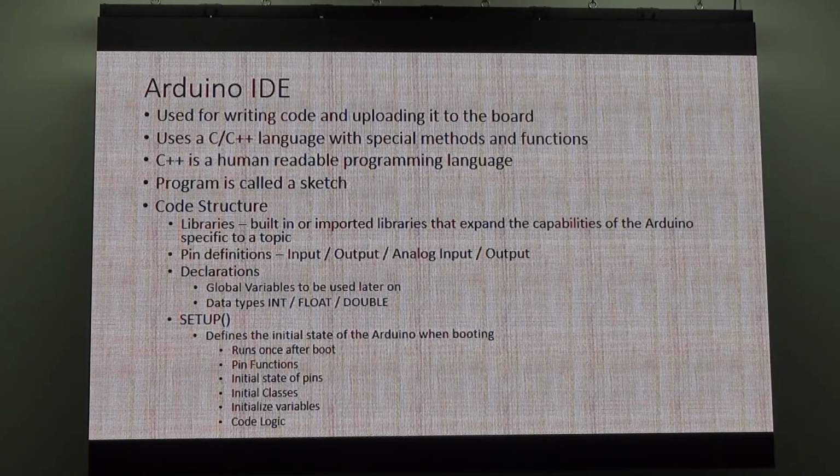Keith's way of writing software for his controllers is very, very efficient. Keith writes in assembly. C++, I wouldn't say it's inefficient, but it's nowhere near as efficient as assembly, like Keith writes in. So when Keith says he can fit a lot more information on his controller, that's because he writes in assembly. So for something that I use, like for this APRS setup, he could probably use a very small controller where I've used a 328P. You could use something a lot smaller if you could write it in assembly.